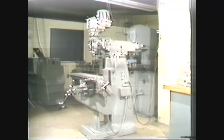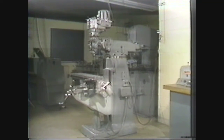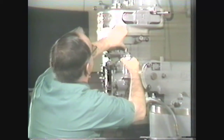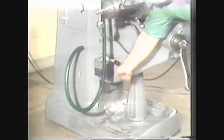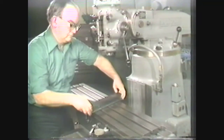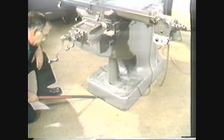The vertical milling machine is generally classified as a knee and column type machine. The name is derived from the two major design features: a main vertical frame member in the shape of a column, and an adjustable knee-like projection mounted on the front of the column. Vertical milling machines must not be operated until they have been properly lubricated according to the manufacturer's specifications. Check the machine for level by placing a precision level on the work table in the longitudinal and transverse directions. If it is not level, make adjustments under the base of the machine.